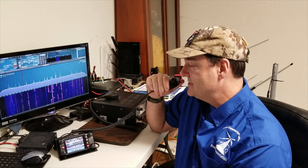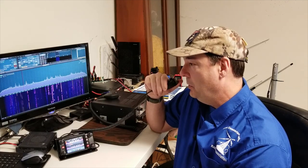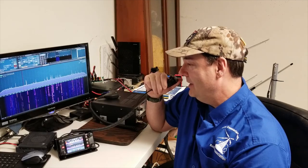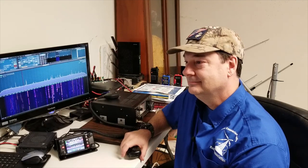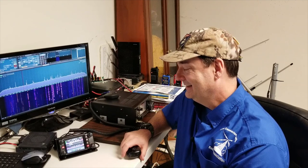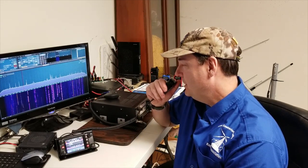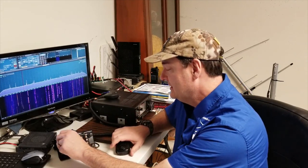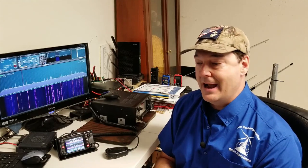I appreciate you standing by for these tests, Don. We're going to go ahead and cut this segment. This is KY4BDP for AC4DM — this will make for good YouTube video. AC4DM clear. KY4BDP clear. So the repeater is now installed. It will work on analog or digital. We have it running in AMS, so it'll receive on digital or analog and reply back on the same. We've got the antenna installed — a Comet GP3.